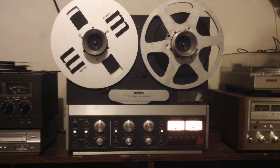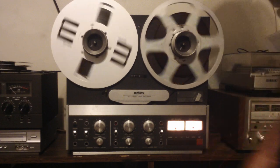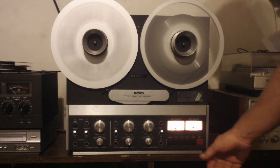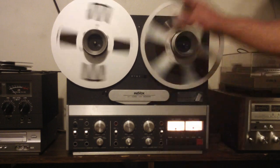It has been aligned with my MRL calibration tape so all the record levels are great and the playback is what it needs to be per the manual. You really had to go and find a good bearing for these reel motors — some of the ones sold in kits are not that great. Looking for the ABEC7 — they make a nine but I don't know that it's worth it. The seven works perfectly, and the brakes are all adjusted.